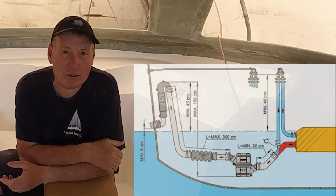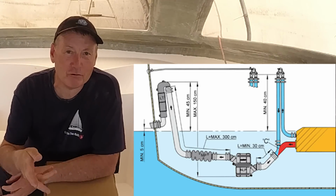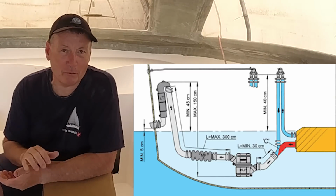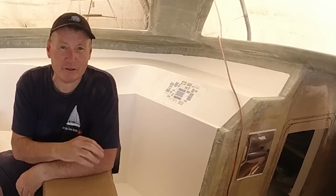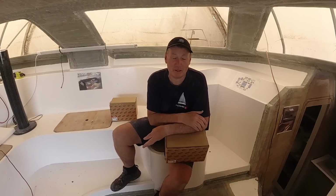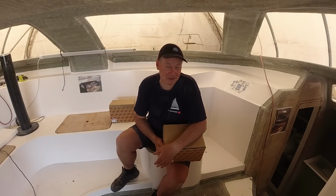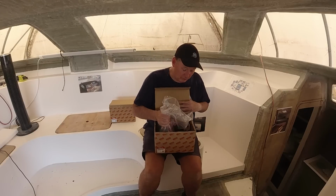Now that's pretty important because in a marine motor where you've actually got water mixing with the exhaust, and then the potential for siphon back of water from the engine and from the water lock muffler, you need to really circumvent that problem. That means we need to elevate that exhaust riser up around about this high and almost above water level. I think it was around 30 centimeters above our water lock muffler. Now we had around about 15 centimeters, so we made the order, and yeah, 1,500 Australian dollars each. These exhaust risers are around about 1,000 US each for each motor, and because it's a catamaran, guess what, we get to do it twice.